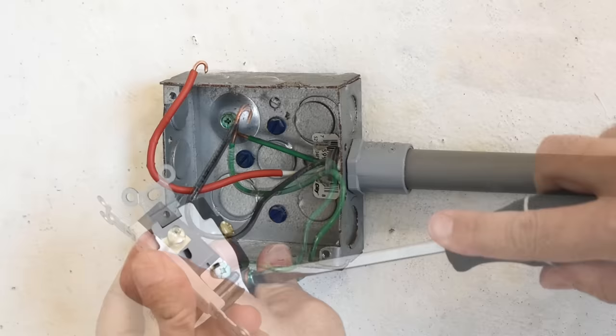If you do not want a receptacle but would rather have something wired directly to this box — if you have a metal box like you see here — just put a blank cover over the front. There are many knockouts you can pop out; you can connect armored cable or liquid-tight conduit from the box directly to what you want to power. If the box is inside a wall, put a blank cover with a hole in the center and come straight out using liquid-tight or armored cable.